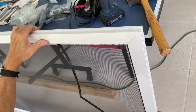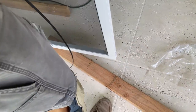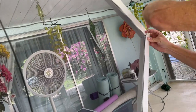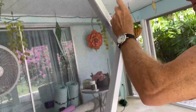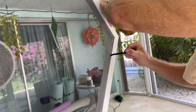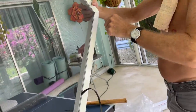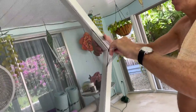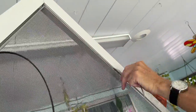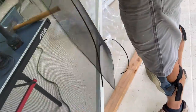We're going to pull it about 10 inches down on either side. Pick the door up and pop up that spline on the other side, then very gingerly and carefully pull the screen out because we don't want to rip it. They already trimmed it, so there's not a lot of extra material — make sure you don't rip the screen. That is an important point.